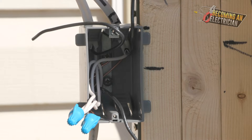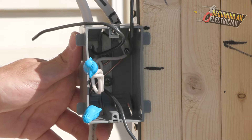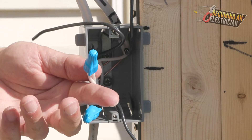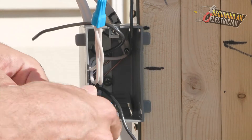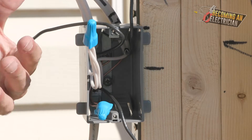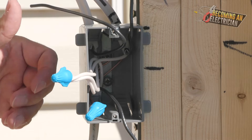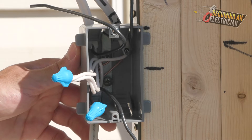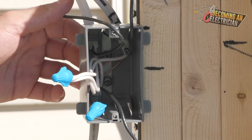Don't push your wires in yet — leave them as is. It's really important to understand your splice. Whenever you bring wires into a box, everything gets bonded — that's the number one rule for electricians, you bond everything for safety. If this is all one circuit, you're always going to splice your whites together, which is your neutral — actually your ground at the panel. This is a bond, not a ground. Your ground only happens at the panel and that gives you your 120-volt potential.